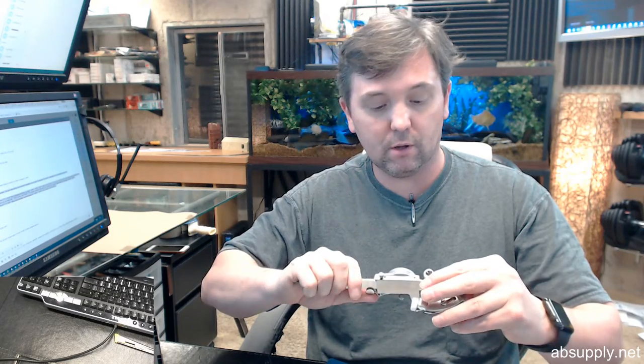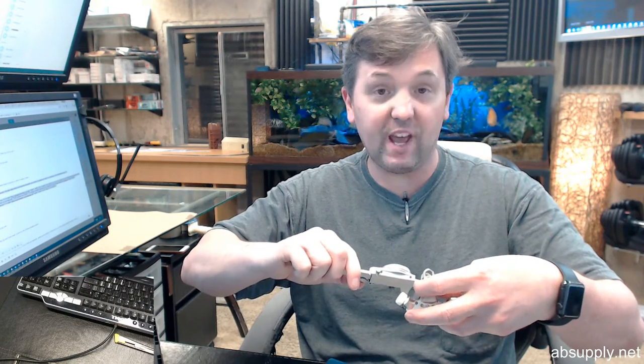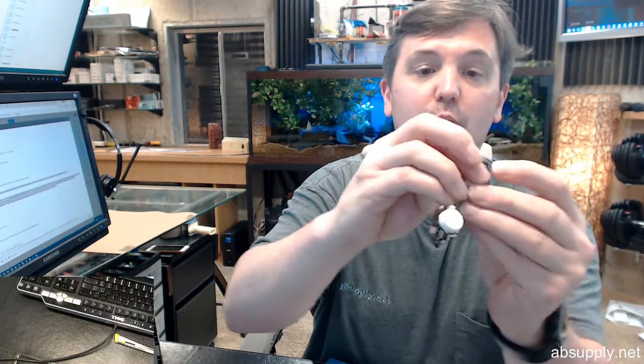Now, the inside dimension without the bushing, and that's really where the question comes in. Can I use it on a commercial grade 4.5 thick hinge or size hinge? The answer is yes. The inside dimension of that is 0.315 inch, so 5/16. I've even had people slightly drill that out as well. So as long as your hinge pin is going to be in the 5/16 range in terms of thickness, you'll be in real good shape for this to work.